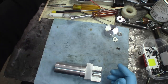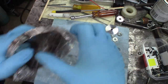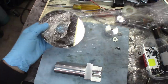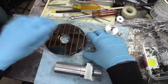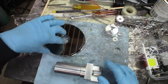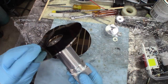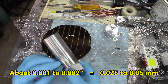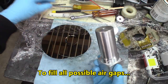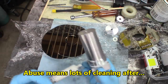For this step I'll be wearing gloves. I washed the platters — the hard disk platters — because I had fingerprints and all that kind of stuff on them. If you get greasy stuff on the platters, what will quickly happen is that dust will stick to it. You don't want any more reasons to have dust sticking on this. Now I'm going to start the fit on this. The fit is not loose — it's kind of a slight interference fit. So I'll be adding just a very little bit of transfer paste between every stage, but very little. This is not the time to abuse the paste.